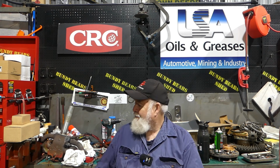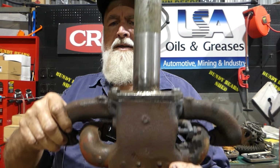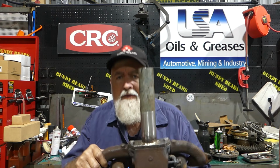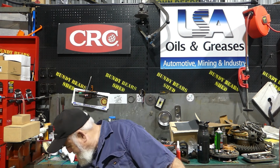So I've needle scaled most of the tractor down now, and the exhaust elbow broke off, and it bolts on top of the manifold here. This is a petrol kerosene manifold for the Farmall 100, and this top snout here was all broken and welded, so you can see I've made a new one of those. That took quite some time. Just getting the bottom flange the right shape, right size, the hole in the right place, and all that. So that was Saturday's effort.